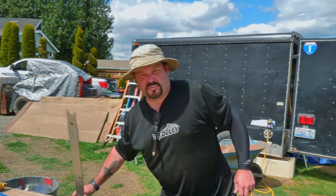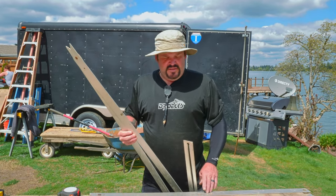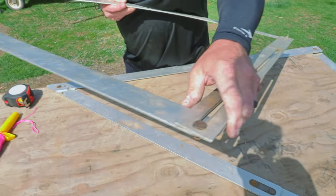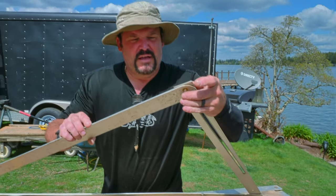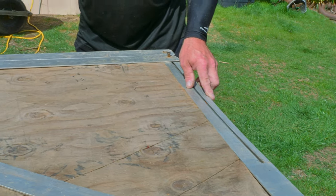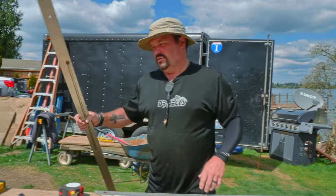I use this layout square all the time — I actually have two of them, which I sometimes use both at the same time. This one is made by Stanley; this one is made by a company called A Square. This one does come loose a little bit right here — it's spring-loaded. You got to make sure that point stays locked in, because if that spring gets knocked, it can knock the square out of square. But it does exactly the same thing. The Stanley square is like an equal distance from here to here; the other one is similar to a 3-4-5 technique but in a shorter distance. The cool thing about these is they fold up and don't take up a lot of storage space.